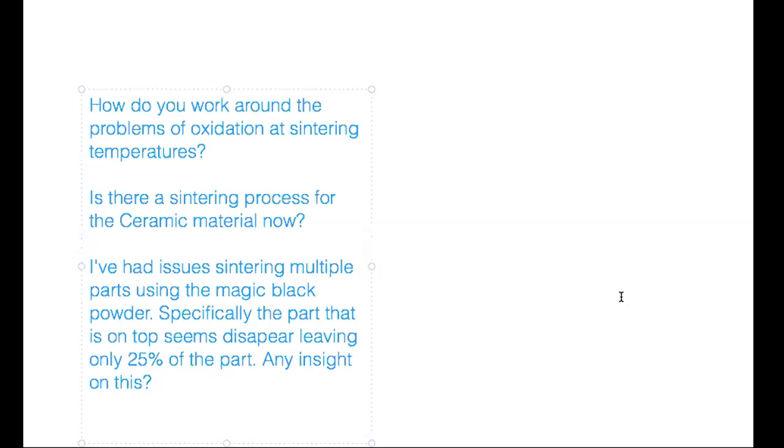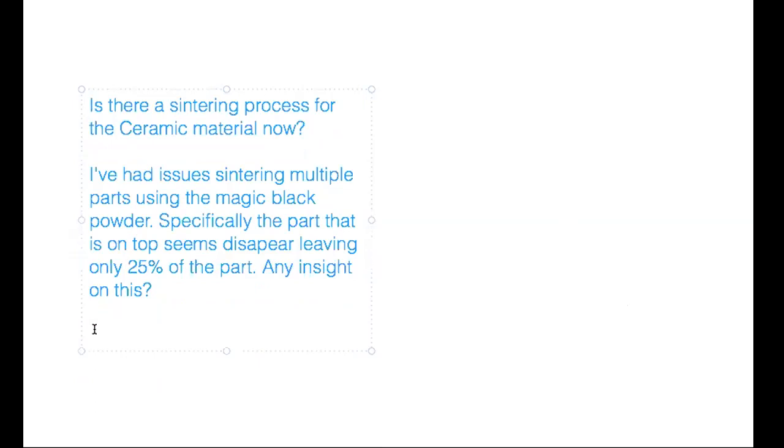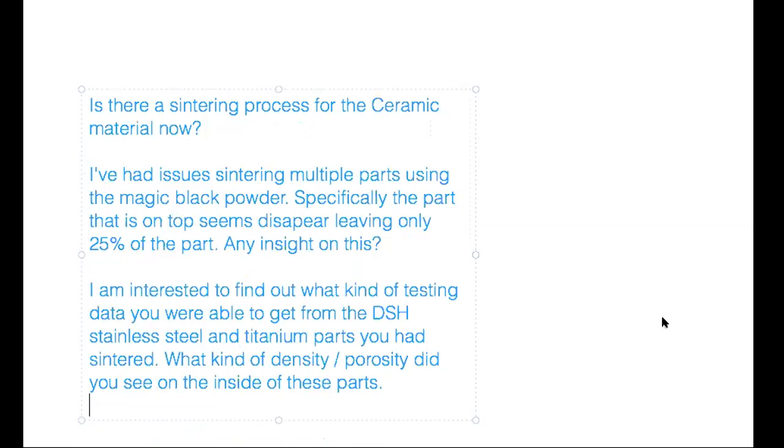There is a sintering process for ceramics. I've sintered several of their ceramic materials starting with a process I had used for material from a company called Tethon 3D, and I was able to get good results. It's not optimized yet, but I was able to get fully ceramic parts. The ceramic material content is pretty low right now — early on the stuff I was using was either 40 or 50% — so there's quite a bit of shrinkage on the ceramics. We've got a base cycle that we'll post. All of our cycles are being edited, and we're going to host them or provide them next week so they can be posted as base processes.